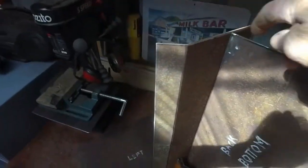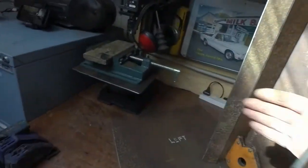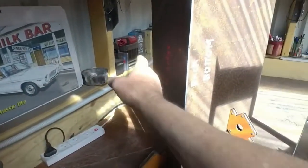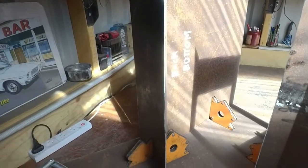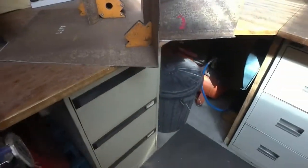So the sloping back and the internal smoke shelf with the little lip on that, so that when the smoke comes up here, forced around here, turns around that way, if it doesn't want to go up the flue and it decides it wants to come back down, it hits this ledge with the lip on it and is encouraged to turn back up.